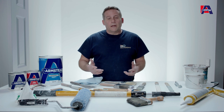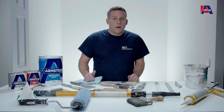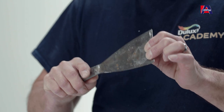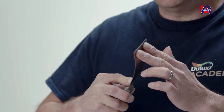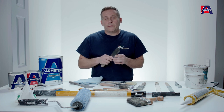First off, with regards to preparing: sanding the surface down is always worthwhile, and it's advisable to wear a mask in case you inhale any dust. At the same time you might want to scrape the surface and remove any debris. Make sure you use a scraper, which is a rigid version of what some people might think is a filling knife — whereas a filling knife itself is actually flexible, which allows the filler to be pushed into the hole for a more permanent fix.